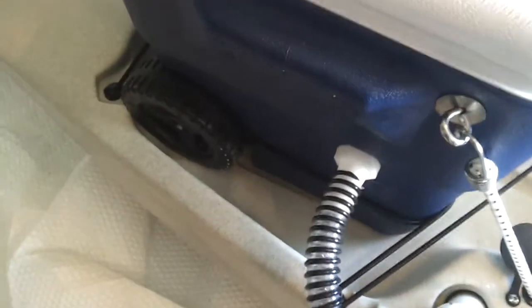Any additions that I put on, I added them to the side where there are things protruding already. I added these shock cords here, which are mounted to these pad eyes, and they go into these stainless eye bolts that I put in here. Those I also got from West Marine, and these are just the intakes, and then that drainage down there are just through holes. The drainage is 3/4 and the intake is 1 inch.